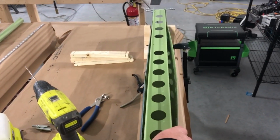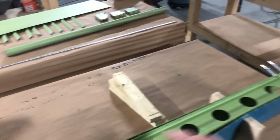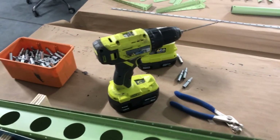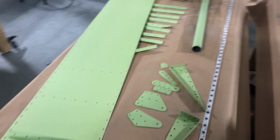I don't even have the pieces together, and you can see there's just, by nature of the way the skin is and stuff, there is a lot of pillow. I don't have anything in here yet, and you can see how the skin is puffed out based upon the alignment. So yeah, I will tell you that once we start riveting and getting the skin, it's amazing how much of the slack gets taken up. The skin is actually very loose. Once everything gets riveted together inside the jig, the skin is very loose. It will move. It just tells you how much spring these skins have. So, all right, so we got that to do today, and you guys know the routine. Plane's not going to build itself, so I got to get to work.